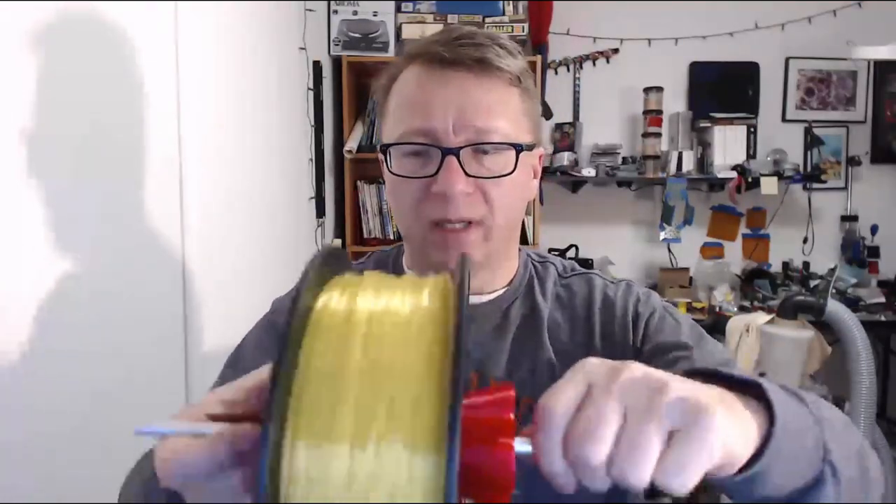And you're good to go — as it spins it lets the filament feed. What I have found, just as a matter of note, is some of those spools are not balanced very well. So if you spin it — this one actually seems to be fairly well balanced — some of them over-rotate so the filament kind of spools off the end and hangs in front of the printer. I don't think that's a big deal; it actually creates a little extra filament buffer in front. For the Prusa i3 Mark II that I have, it's no big deal — the filament's not going to get tangled. But for other printers it might be a problem. You could also probably take this design and create a base for it, which I might actually do — just design it so it can sit on your desk if you've got a Bowden setup or something like that. But this is the basic idea.